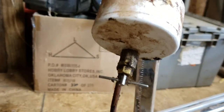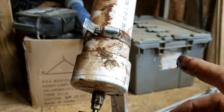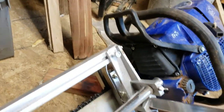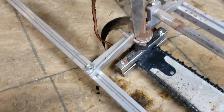You've got to have that needle valve right there. When you turn it open, it slowly starts to drip down. I've seen these where people put them straight up and down, and that's okay, but when you go to work on your saw and set it down, its tendency — because of all the weight out here — is to tilt down. If you put the oiler at an angle, it stops it from tipping down as far and keeps this end up off the ground, where the oil won't leak out your air hole. That's why I put mine at an angle, and it has worked like a champ.